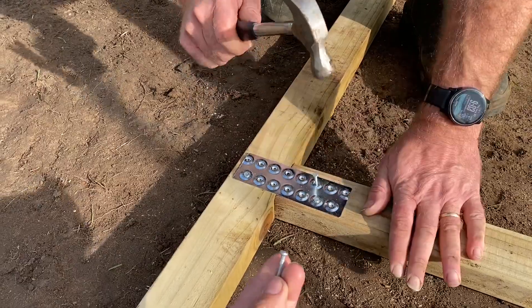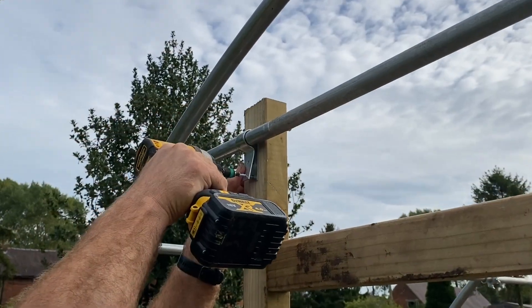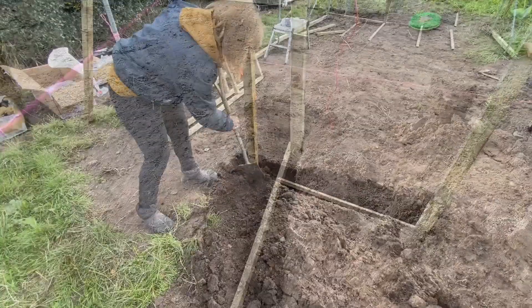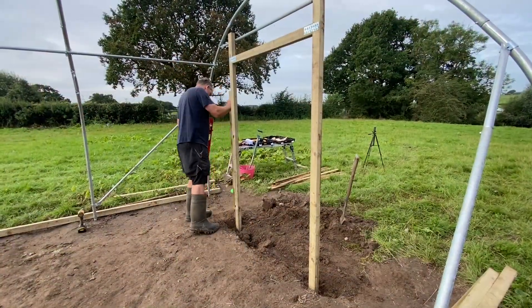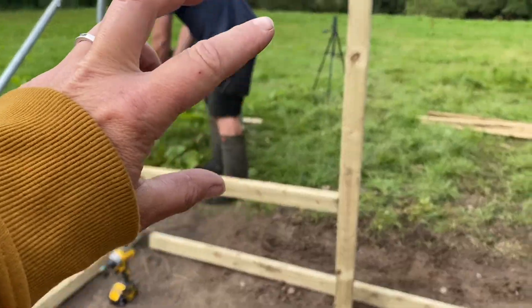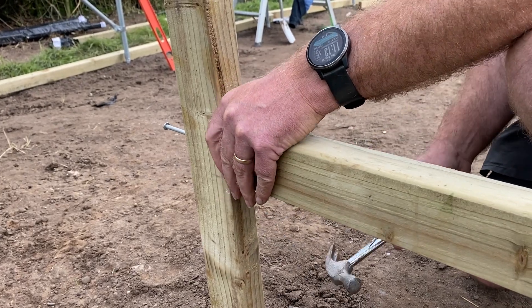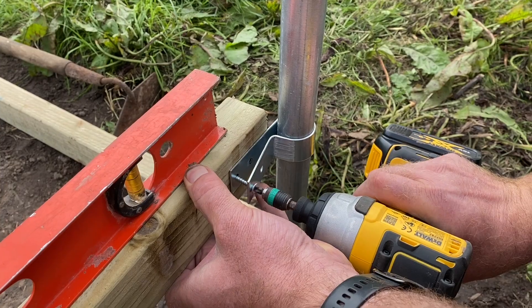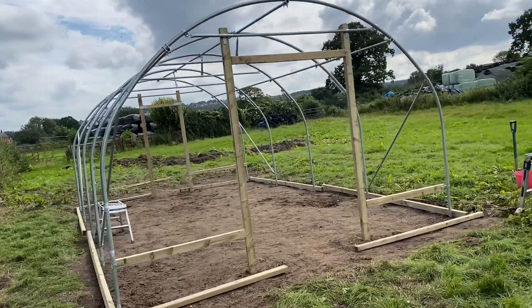More support plates for the door frames - just tacking them off. Just made a bit of a plumb line to mark the middle of the door, so the middle of the door we will now line up to the plumb. Draw a bit to the top frame with T-clips, just filling those in. The next step is to put the support bars in, and these are to help take the strain of the door as it slides open. The next stage will be the timber base rails, battening and the hotspot tape before we get to the polythene.